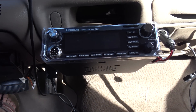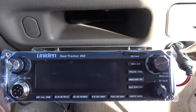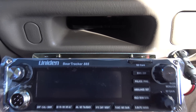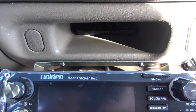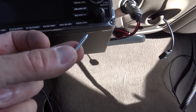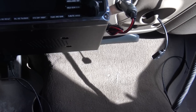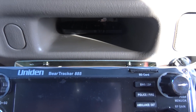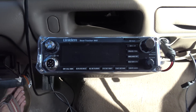The screws that come with most of these units are not self-tapping screws — they have nice knurled threads. What you want to do is not drill a full hole. I took a pointed screw, pushed it in just one or two turns until it started to grab, pulled it out, then shoved the mount screws in. They really grabbed onto the plastic in there and this thing isn't going anywhere — it's solid.